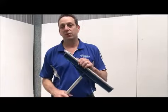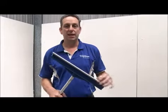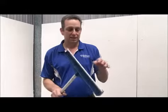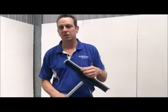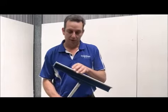So today I'm doing a solventless epoxy roll coat, and rather than work out of a tray, it's only a 50 square metre area. It's pretty tight, so it's sort of long and narrow, not ideal for using a squeegee and wet back roll, but I really wanted to try out the easy squeegee tool, and this is for thin films. Like, there's a lot of squeegeeing going on at thicker films, but this is a gauged thin film squeegee, and I wanted to have a go at it.